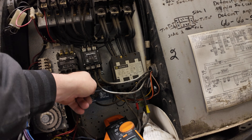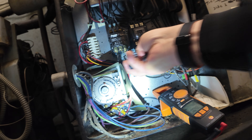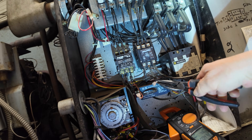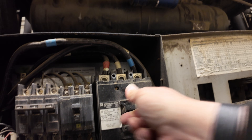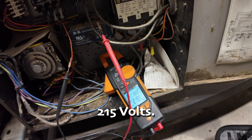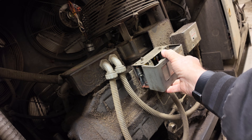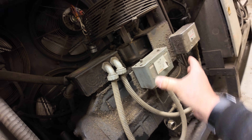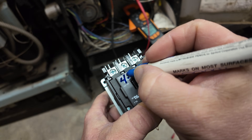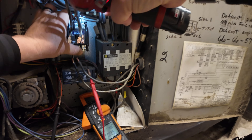For those eagle eyes out there — yeah, I forgot to turn the breaker off up on top. Not one of my smartest moments. But look at that: 215 volts — got another bad contactor, but we got lucky. If memory serves me right, I think the oil pressure switch failed out. Sometimes they're getting power off another leg, so if they lost power on that particular phase to the control, that could have caused a problem — I don't really remember, to be honest.